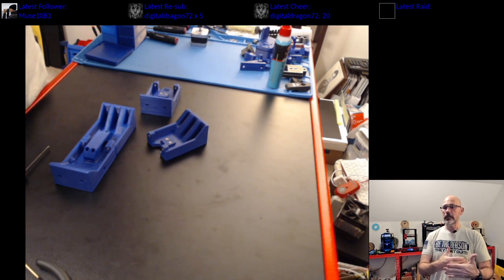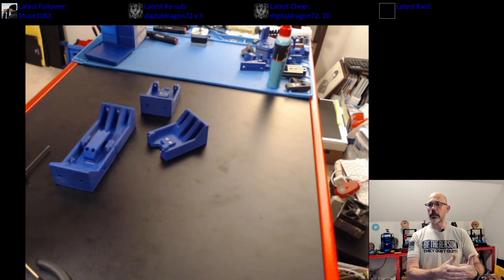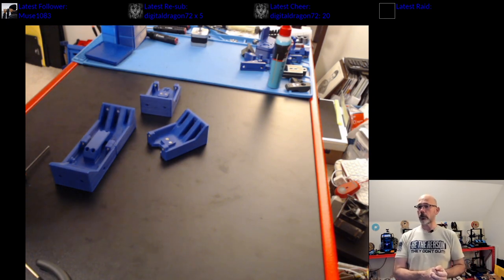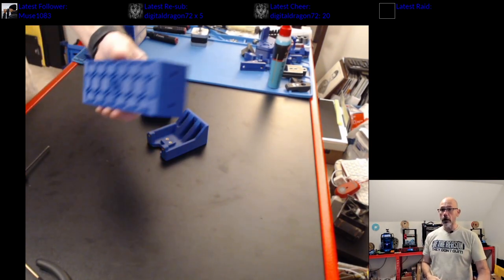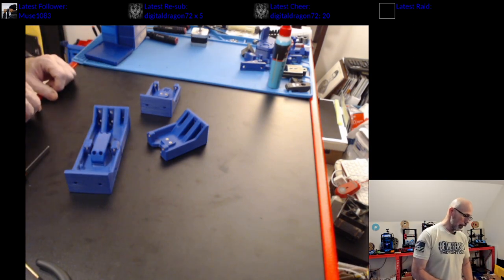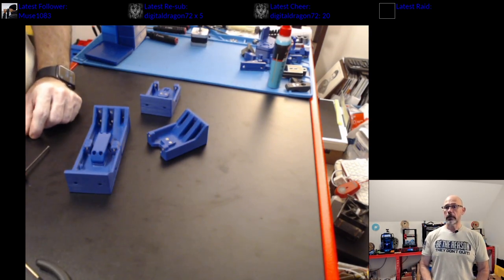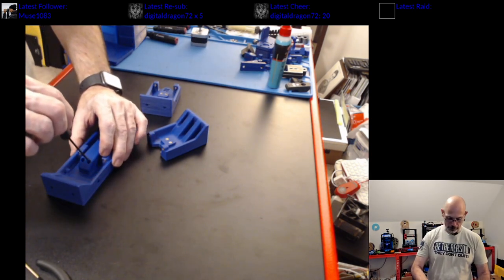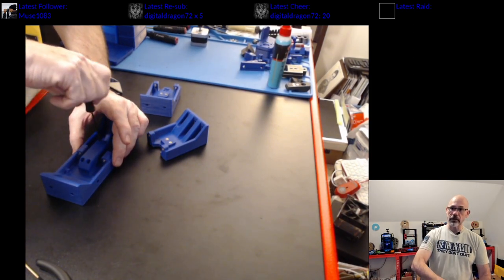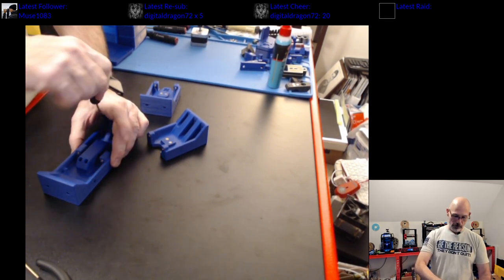I went to the Kirigami bed, it's straight aluminum mounting straight to those carriages. I set my bed level when I did that mod before Christmas. I have not leveled the bed once. And I've been printing, I printed all of these parts except for the middle section of the, actually I think I did all of the front skirts. I printed all of those on the Ender, just because the middle piece, the little ears that mount between the two end pieces, made it too big to go on the V0.